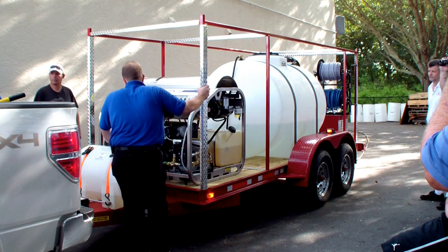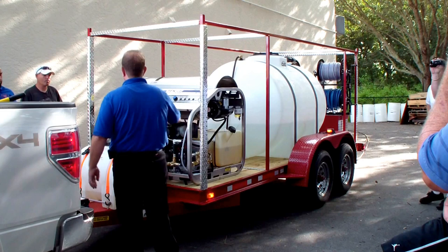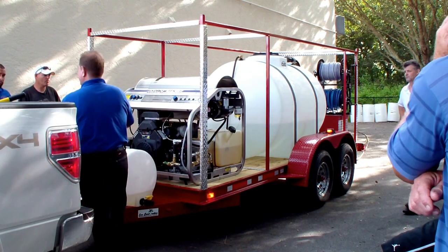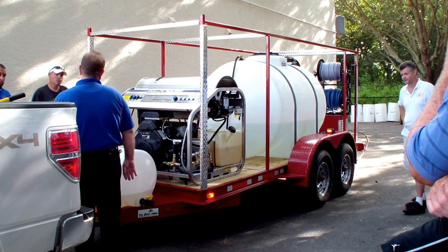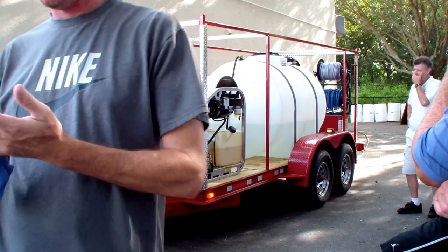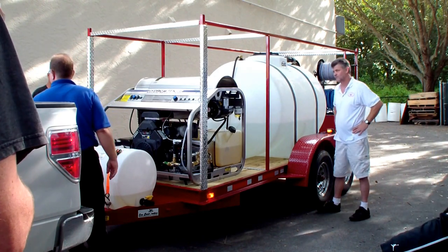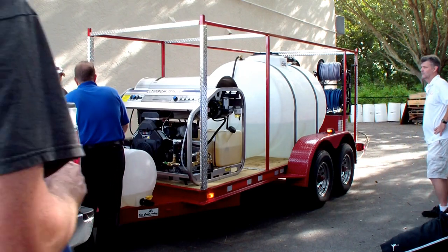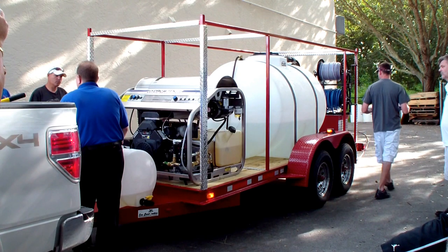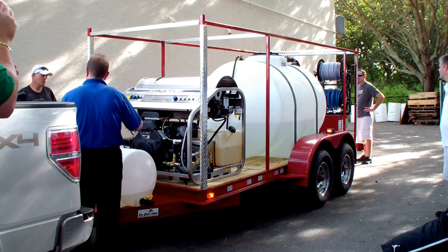We should get a closer day out of a tank of gas — at least probably a day and a half. They used to have 18-gallon tanks before this, but the EPA changed and they had to add all the CARB canister systems. So they went down to an 8-gallon tank. I kind of wish we had the 18. There is actually an option where they offer an 18-gallon tank if you need larger capacity, but in California it could be a $50,000 fine for them. If you have a long commercial day, you're probably going through that tank — just have a spare five-gallon gas can handy. The tank doesn't drain all the way to the bottom, so you'll only get about five and a half to seven gallons out of it.